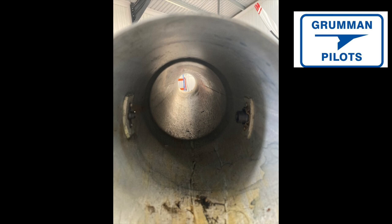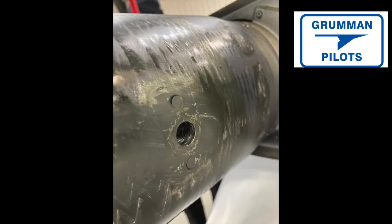These are close tolerance measurements and you don't want any wiggle in there, because wiggle leads to wallowing and you'll ruin your spar. For those who may not know, spars for Tigers are getting extremely hard to come by. Fletch Air has a several-thousand-hour spar, we have a five-thousand-hour spar, and there are a few others out there — but when those are gone, they're gone.